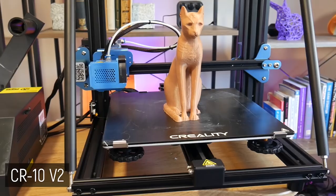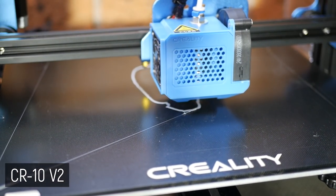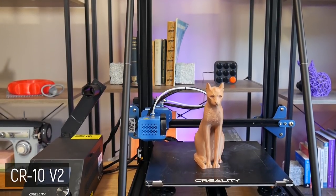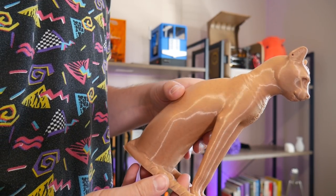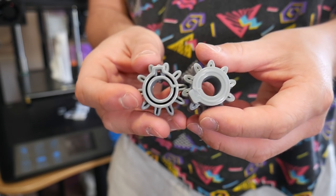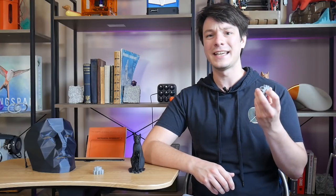This is the CR10 V2, which I reviewed not too long ago. In that review I mentioned how I think it's a little silly to have a printer with such a huge print volume but still fit it with a 0.4mm nozzle. This is great for detailed models, but honestly I don't have the patience to wait literally days for a large print to complete — that's just far too long for something to go wrong. So at the end of that review I tried a few prints using the 1mm nozzle and the results were very promising. What applications could a nozzle like this lend itself to? What are its benefits and limitations?